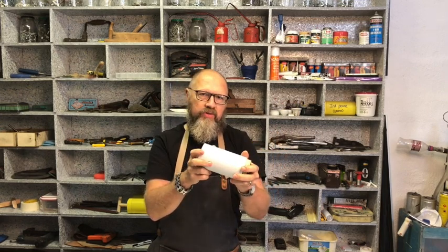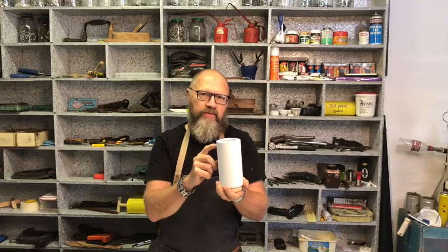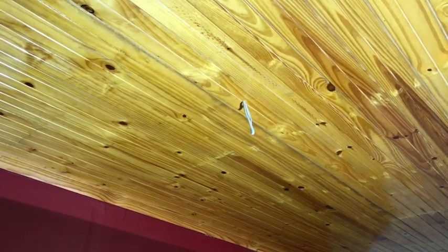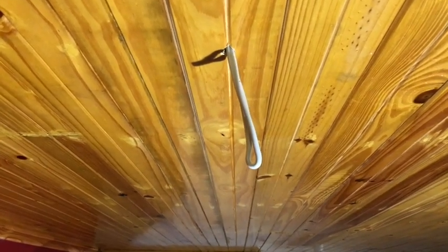So let's move on to my kitchen where I'm installing them to show you how this gets installed. So this is one of the places where the downlight is going to get installed. I've already did the wiring in the roof. What I did is I looped the wire like that, and it continues to the other locations where the other downlighters are, and basically I need to strip this and slide the whole fitting over that and do the connection.